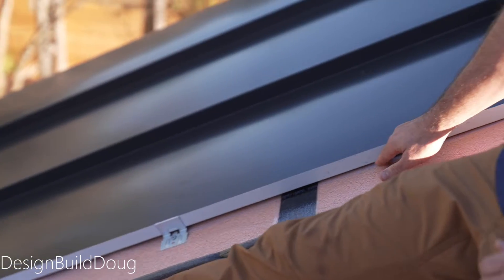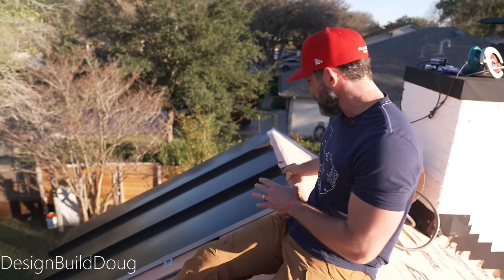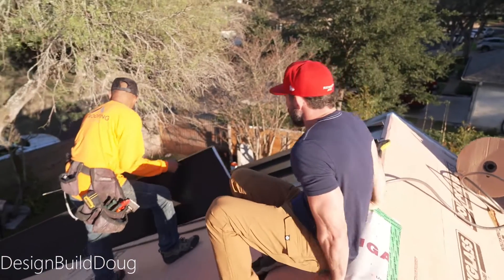So I wanted to elevate it up, give it some minimal ventilation. I was going for a minimum of a quarter inch everywhere under here, so that I have the ability to vent under this roof to reduce the surface temperature, maybe by up to 40 percent.